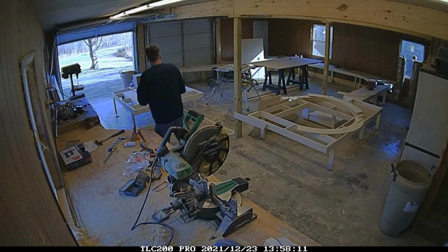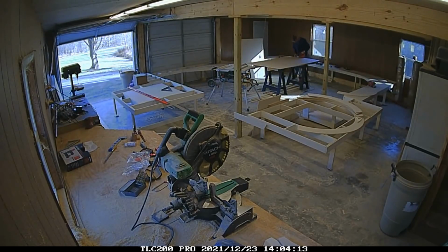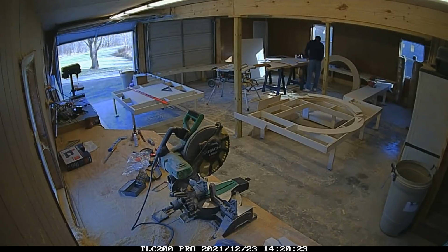Now I'm cutting a second sheet. I did this one slightly differently. I wanted to get 2 half circles out of the sheet, and to do that I had to put one each way so they're partially one inside the other. Now the total yield on the sheet is not quite as good that way, but I had my reasons for it. I wanted to get those 2 half circles so I could join them together to make a ring to plot the bottom of the helix with.